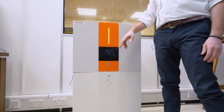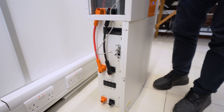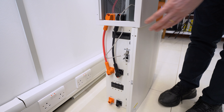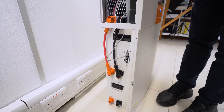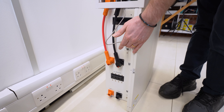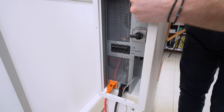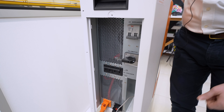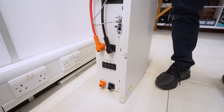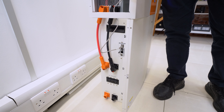If we move to the other side of the inverter and open the covers, you can see there are fully insulated power and communication terminals. The system is very safe to run — there is nothing exposed here. There are AC and DC terminals, the BMS communication, the RS-485 terminal, the DC isolator for the panels, and the AC isolator for the connection to the grid. It's a very well-made system, safe for your property. There is no hazard for fire, explosion, or any electrical shock.